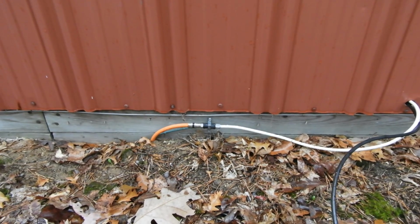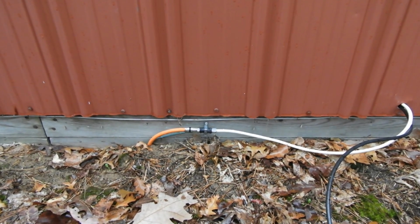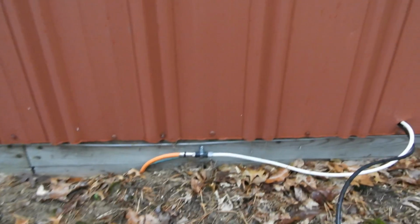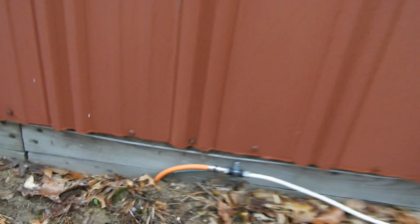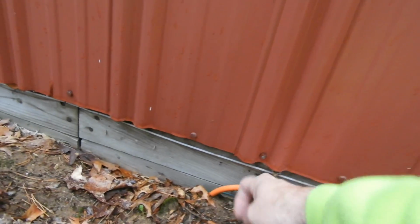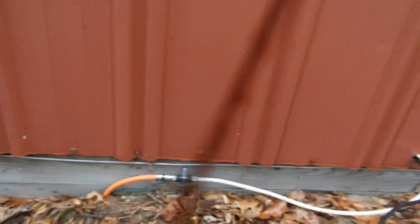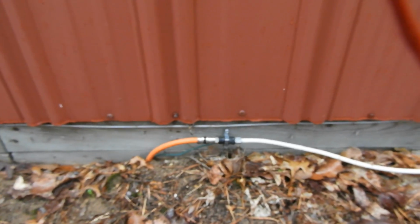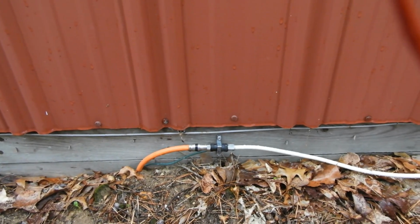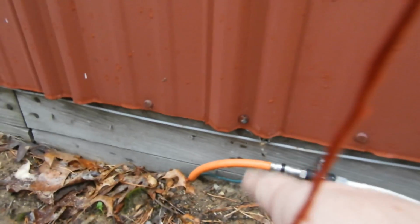So if you walk over to the back of the house or wherever the cable comes in, you should see a ground block, and the connection should be tight and dry here, of course, sealed from weather. This ground block should be on the outside of the house, not the inside of the house. The green ground wire that connects to the ground block can go into the inside, to find ground, but the block itself should be outside.